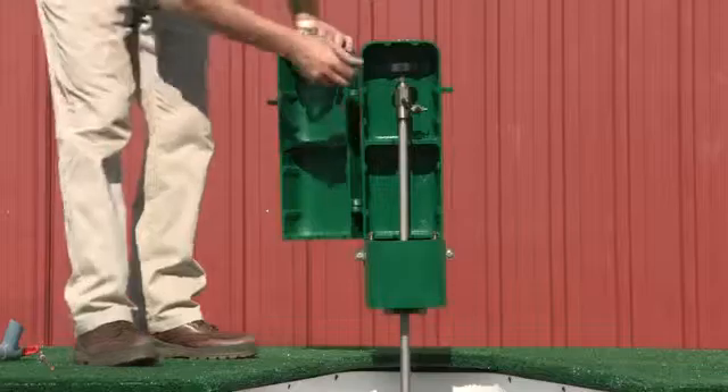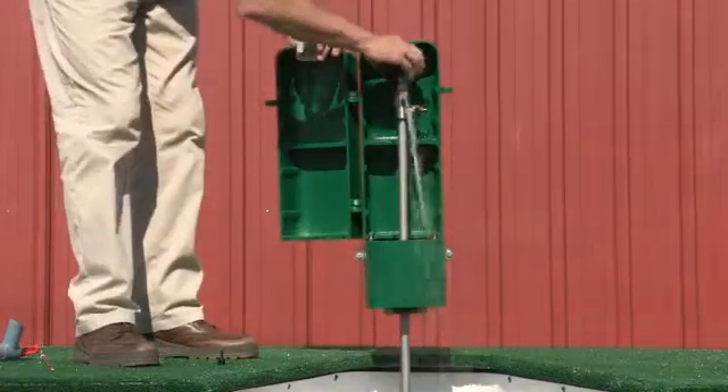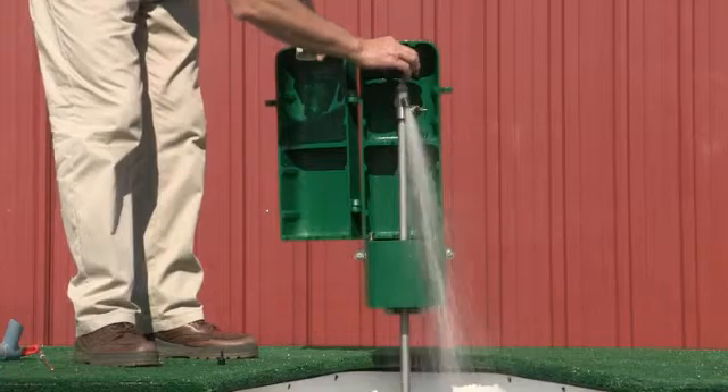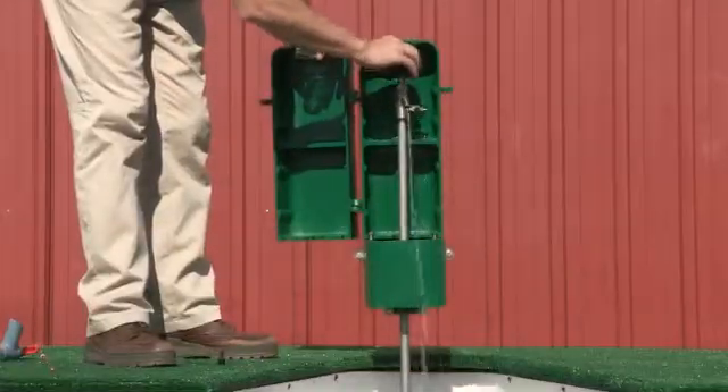To operate the Eclipse 88 WC-SS, first open the enclosure and open the blow-off and let the water flow for approximately 3 to 5 minutes. Turn off the blow-off and replace the protective cap.